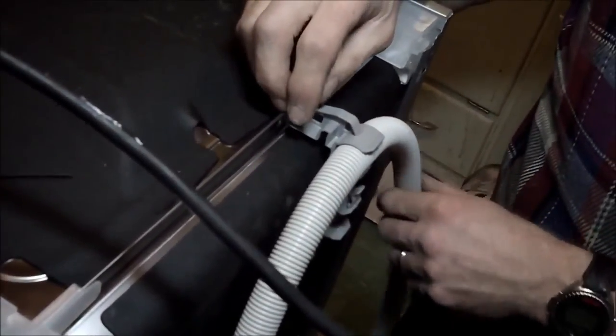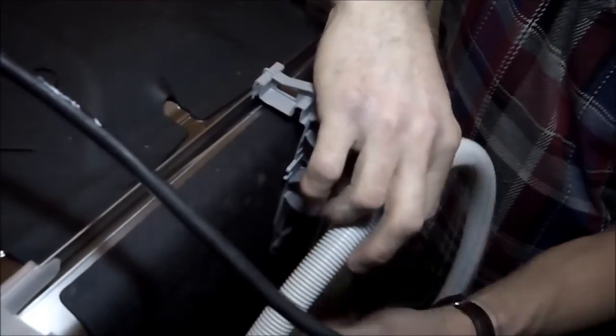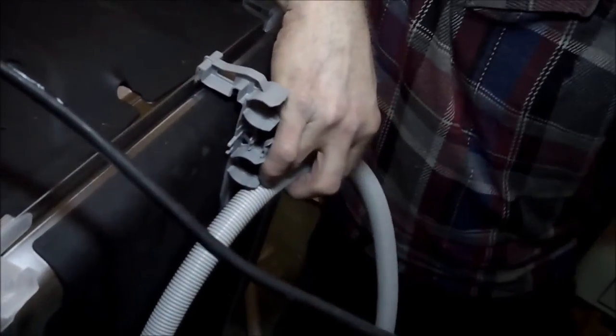So there's some things that have to be done there. Okay, we got a special problem here. This hose has to be 20 inches from the floor at its lowest point, which of course, as you can see looking into the hole, no problem. There's a clamp in there and everything, and the previous position for the old one was just fine. But with this dishwasher, this face here, the very back, has to be touching that mop board down there in order to be far back enough for the trim to be in the proper place. This trim to be flush with the front of the cabinet.